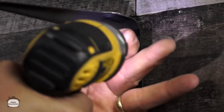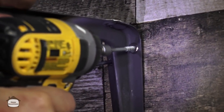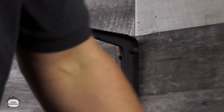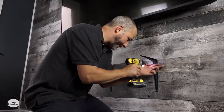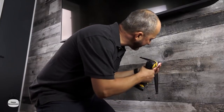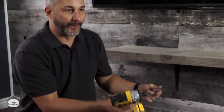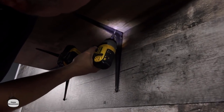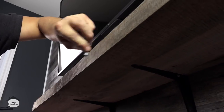Because we have a screw on each side about the width of the stud, you want to go in on an angle. We place the bracket to the wall and drive it in. We tried going in straight and there was no wood there, so angling helps you find the stud. Now we take these structural screws — we use a Simpson Strong-Tie; not sure what's available in your area, but they make these for joist hangers and they come with the bit in the box. We screw from underneath to mount this so it doesn't slide over. Make sure your screw isn't any longer than the actual material you're going through — here we have a screw that's inch and three-quarters going into a two-inch slab, so we're safe.